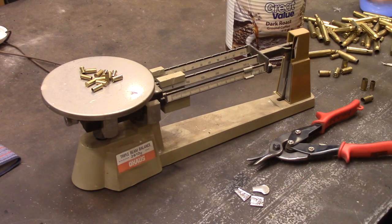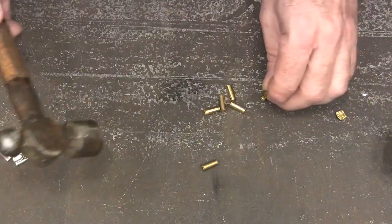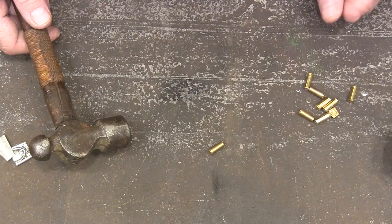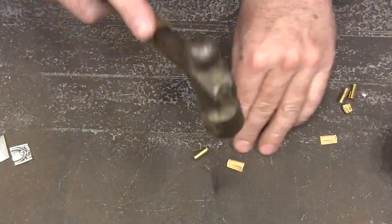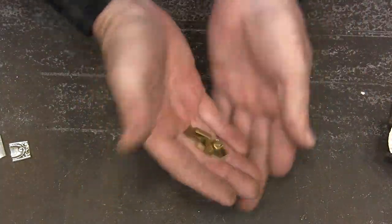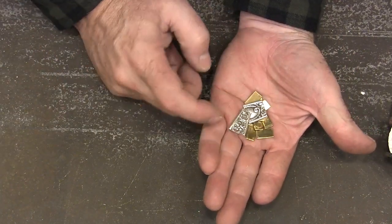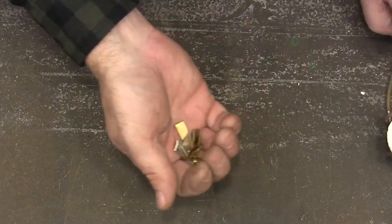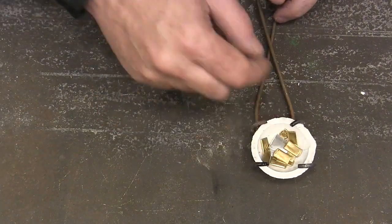So that's what I want right there. These are pretty thin, and with brass you have to be careful not to boil off the zinc that's in there. So I'm just going to smash these. That plus our silver — I wound up having too much, so I actually did one third of what I had and re-weighed it. That's going to be our charge right there and we're going to get that melted.